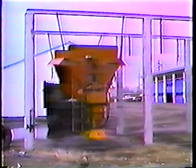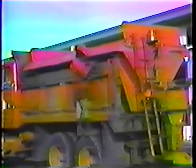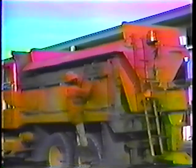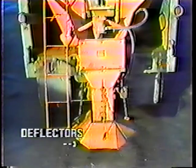It runs by hydraulic power and is temporarily mounted in the dump box of a truck. Basically it's all hopper — the sander carries about 15 tons of material. Inside the hopper there's a conveyor to carry the material to the back of the sander, where the material passes through an adjustable discharge gate. From there the material falls into the spinner so it can be thrown out onto the road. Finally, deflectors at the bottom of the spinner regulate the width of the coverage.